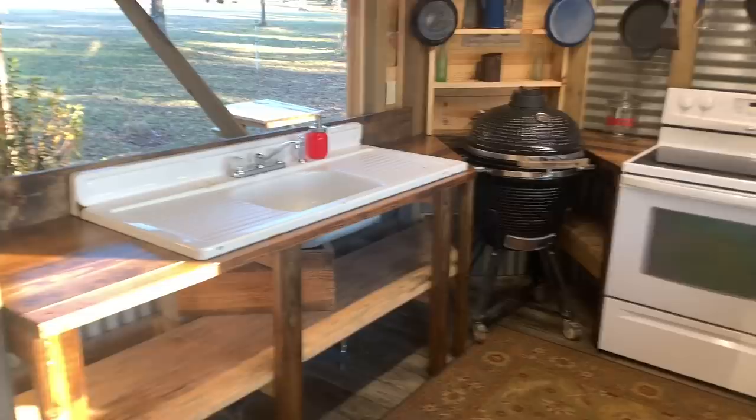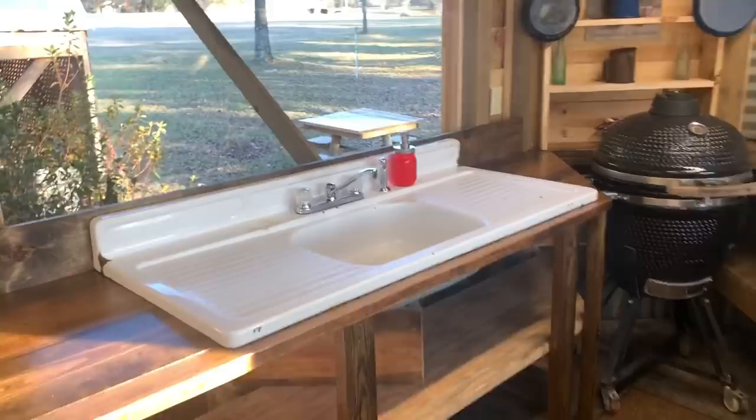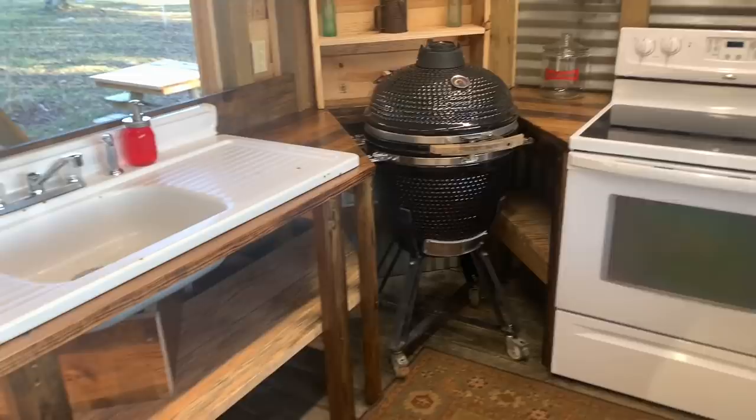Turned out really good on the plumbing under here. What I did is I ran PEX, but I also put a drain in the line so I can drain all of these lines. I can cut this valve off going into that faucet right there and drain it from underneath – that way when it gets cold, we won't have to worry about that line busting.